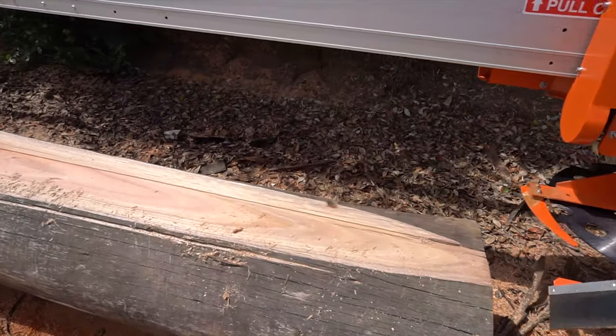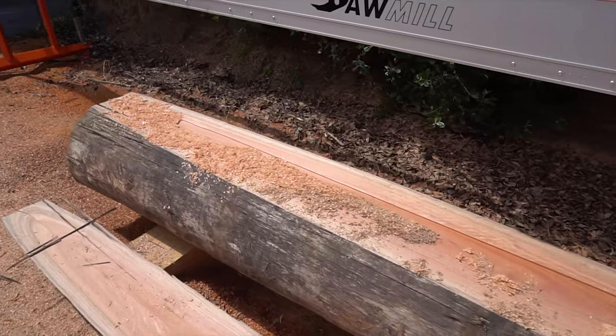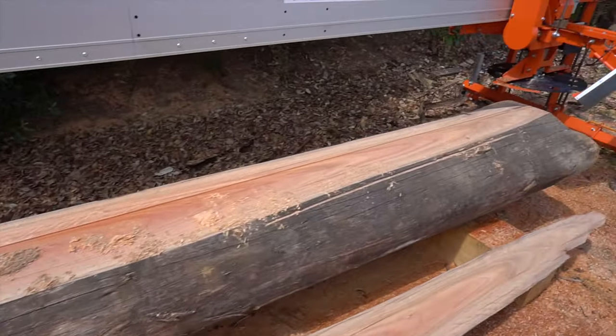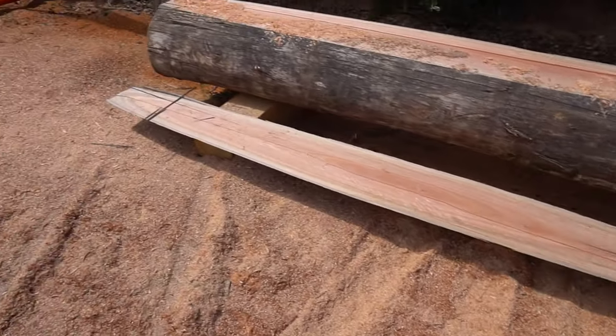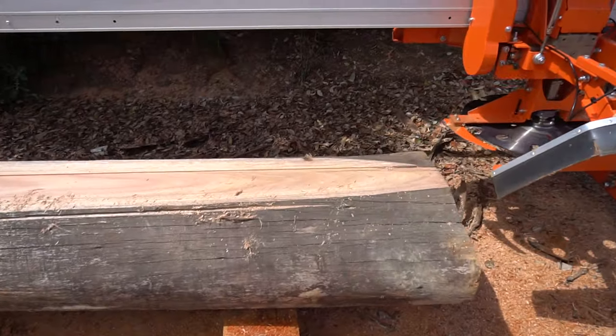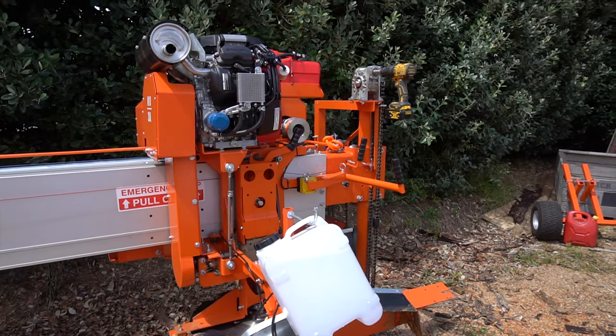Our open cut, and I can see there, as suspected, that there'd be around a 4 millimeter deviation from one side to the other because of our lead-in. So you can see that deviation over here. So what we'll do, we now know we can actually measure the difference there and apply that when we do our reverse cut on the gearbox up there.